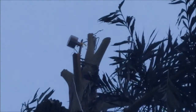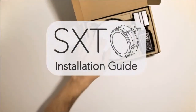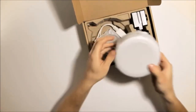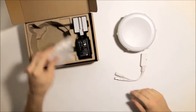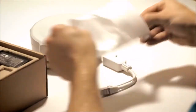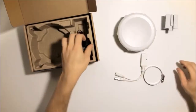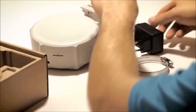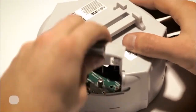I've mounted this device over a pole on a palm tree next to my house. The device is quite simple — it's a 4G LTE modem with something called a POE injector, which means you can power the device using a LAN cable. This is very helpful because a LAN cable has much lower signal drop compared to an LMR 400 cable.